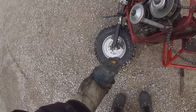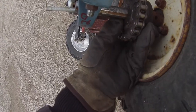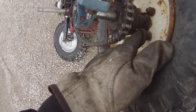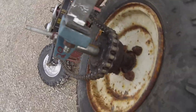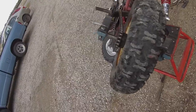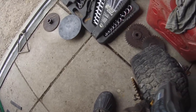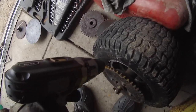It's actually the same tires — what I'm doing here is a three-quarter shaft. The snowblower was set up so that it unbolts, which is kind of cool. I've got a three-quarter shaft, I had some pillow block bearings, and I wanted to make this work because the old tire right here is pretty worn out and it doesn't go very good in the snow — it's just kind of wide.